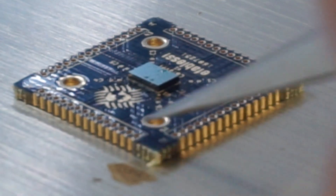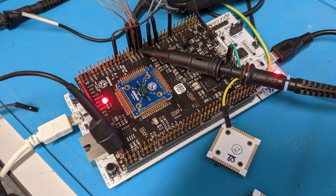Then we take that off and plug it into the test jig that characterizes the GPIOs. That's about it - I just wanted to show my process. I think it would be better with a stencil and some solder paste, but I'm trying to keep this quick and simple since I've done 40 chips so far. Hope that helps you in soldering up your own PCBs - let me know in the comments.